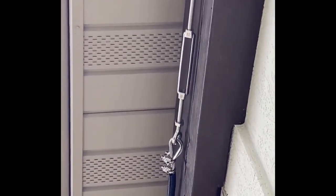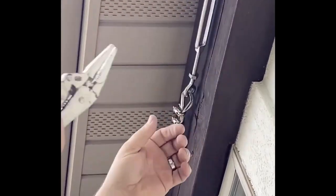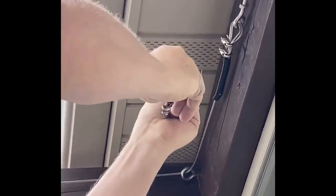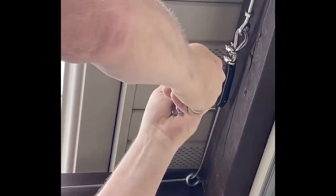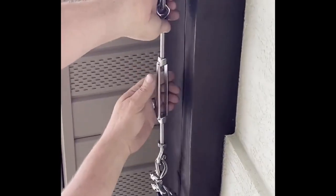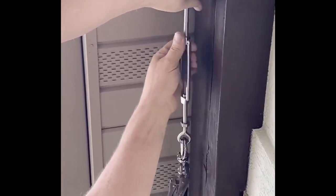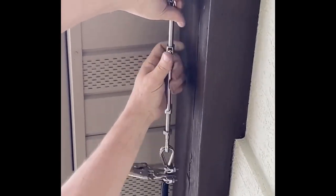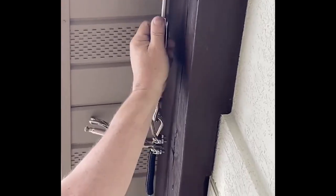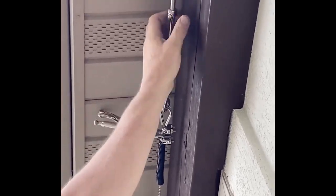The last thing is to tighten it by hand to desired tension. I like to always put the needle nose on one end — very, very important that you don't unravel the cable at the corners. To do that, steady one end and hold it; the only thing to move is the center of the turnbuckle. If you don't do it this way, one of the corners will unravel and there will be just a few threads of cable holding, and when the wind blows it'll break your cable with the seesaw effect.